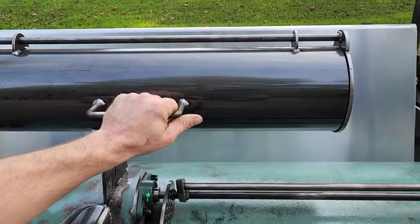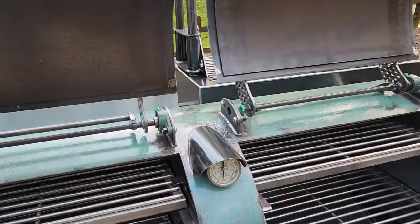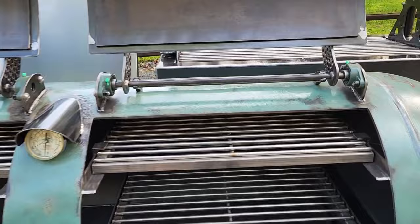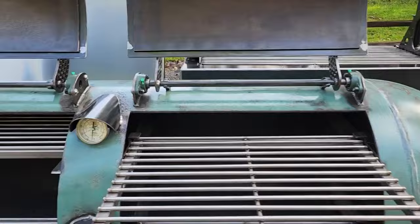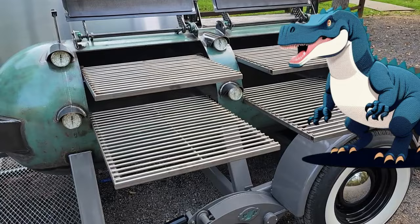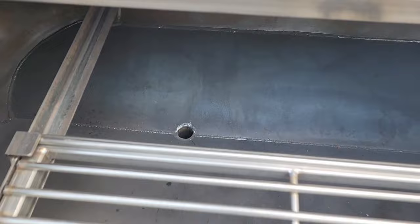Got a handle to flip up your stack and also a clip to cinch it down. He opted for pullouts, top and bottom — top's pretty normal, pullouts on the bottom. 304 stainless grates, guys — these things are freaking killer, built to last forever. Made with 3/8 solid rod and eighth inch one by one tubing. Spared no expense — isn't that what he said on Jurassic Park? In there we've got the insulated bottom, and we've got an inch and a quarter ball valve drain like we do on all our 250s, going right through three inches of insulated bottom. We've also got greasable pillow block hinges. And our handles spin — when you're going up and down you're not sliding your hand on a handle, it's going with you.